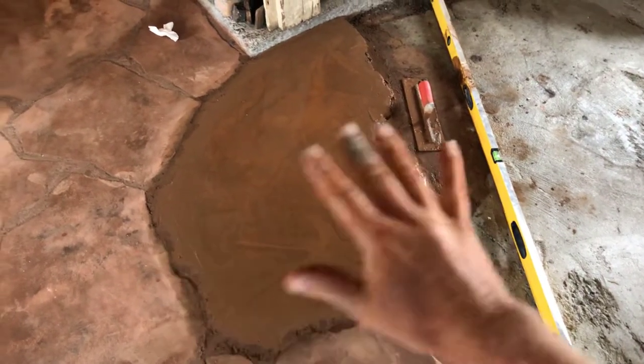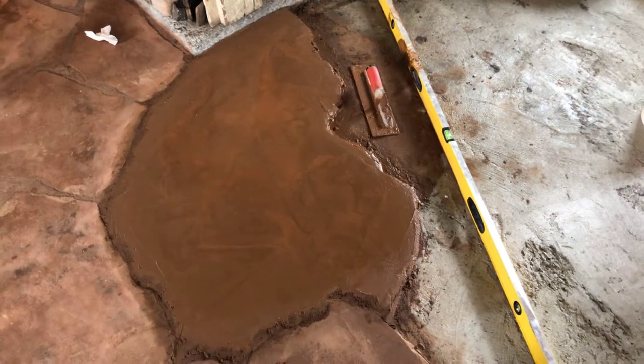It's fun to be able to do one section at a time and not do so much that I waste an entire day or let the concrete get away from me and not be able to do it correctly. That's actually how it was when we poured the rough flooring in here — we had a marked stick and tried to get it as close to flat as we could, but nine cubic yards of concrete is really difficult to do on your own. We knew it wasn't going to be perfectly flat or the right color, so everything combined, this was the best way to do it.